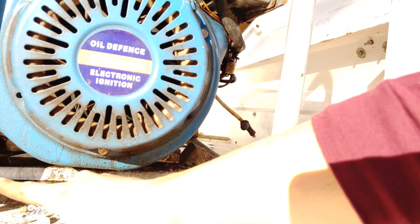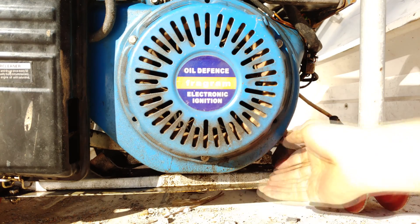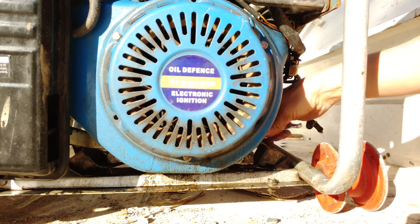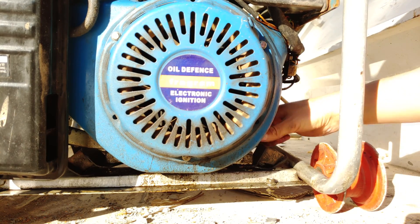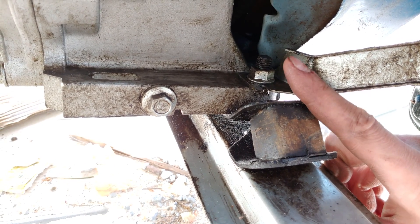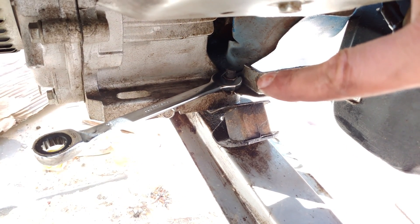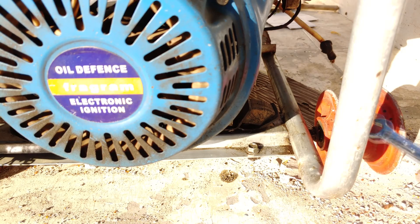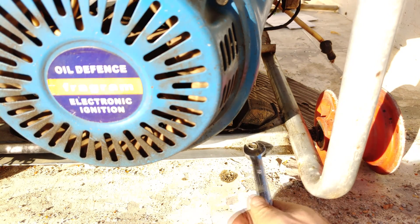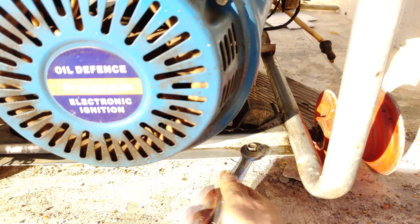Looking at the back, you can see how that mounting is completely collapsed. The one on the left is still fine but the one on the right is gone — you've got to loosen both these screws. On this particular generator, the nut on this side is a bit hidden so you've got to come at it from this angle. You can't release the nut holding this mounting unless you open these screws here and remove the wheels, because there's an axle running across the bottom.